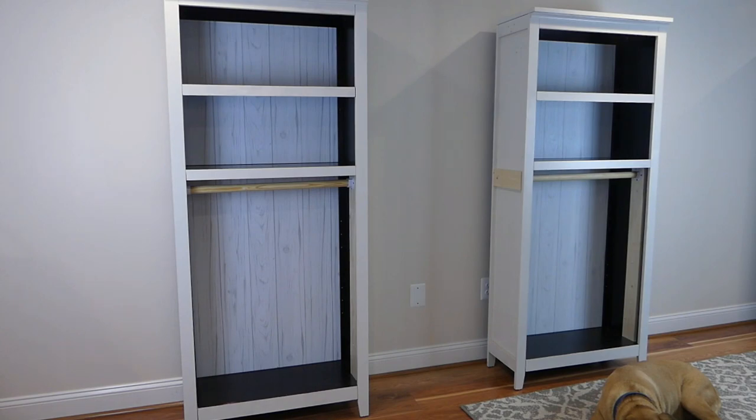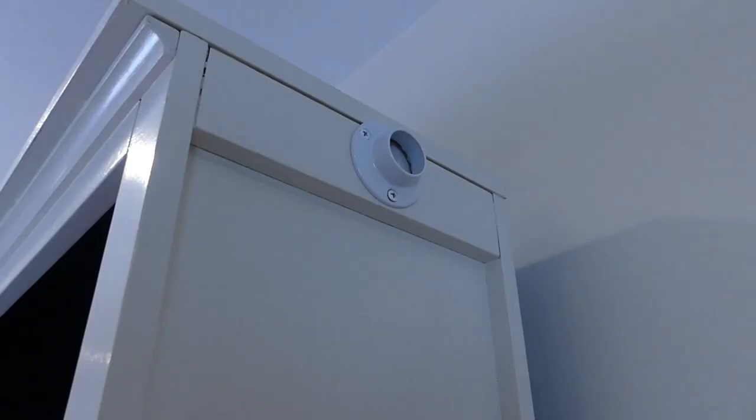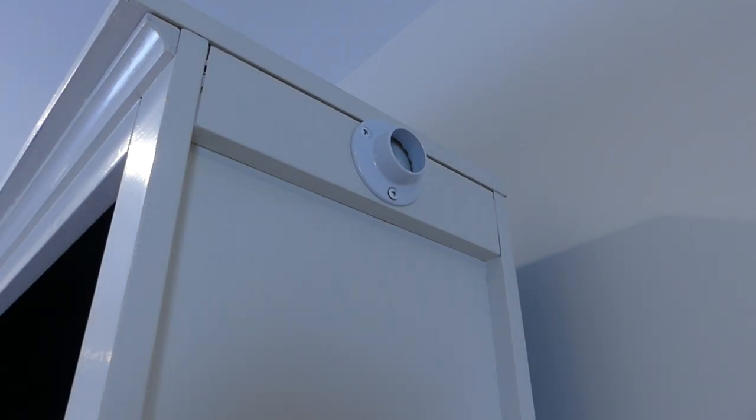To build additional hanging space between bookcases, choose a length less than 48 inches, as you'll need additional support in the middle if you go more than that. I chose to use the same width as my bookcase so it would give the entire wall a uniformly spaced look. My bookcases have additional thickness at the top, so I'm using this space for the pole sockets — I won't have to reinforce these.